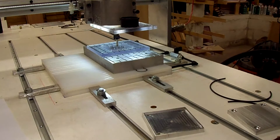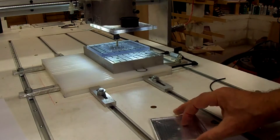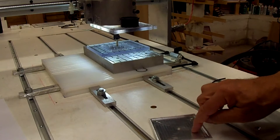Right now I'm zeroing the quarter-inch router bit to the plexiglass plate, and then this is the one we're going to machine first — cutting the center out with the center hole, three-quarter hole, then a pocket, and then a groove for a gasket.